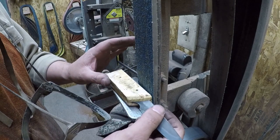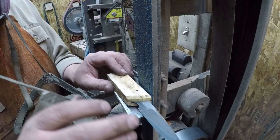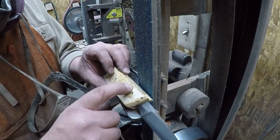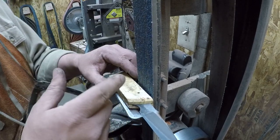Then we are gonna come back and we're gonna get our profile done, okay? Now the easiest way to tell when your profile is done is when your belt starts throwing sparks, because wood doesn't throw sparks. Okay, so the second you start throwing sparks, especially on a 36 grit belt,